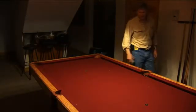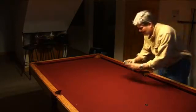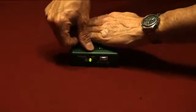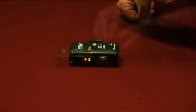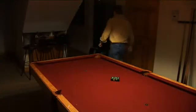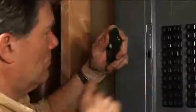In this mode, simply place the transmitter in a room and set it to detect if the room light is on or off. When the light goes out, the audible and LED alerts on the remote receiver will stop. Now the user can identify the right breaker or circuit which powers that particular light, without checking and rechecking if the light went out or needing a helper to check the remote light location.